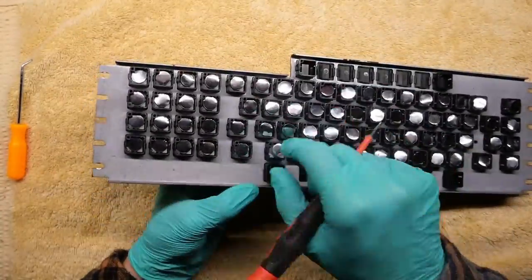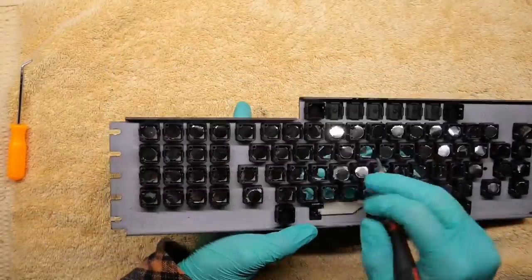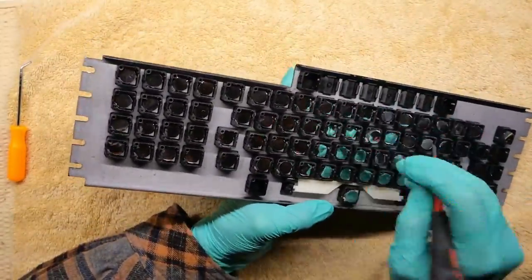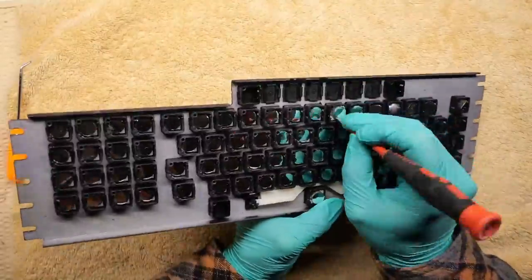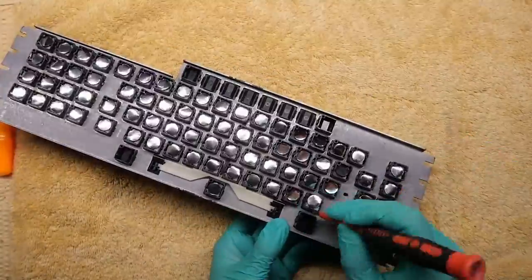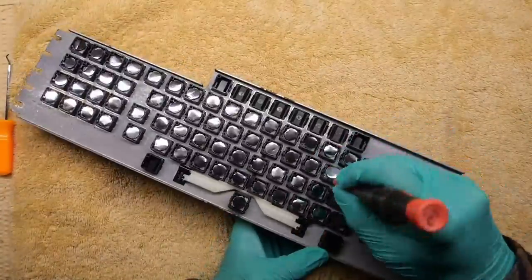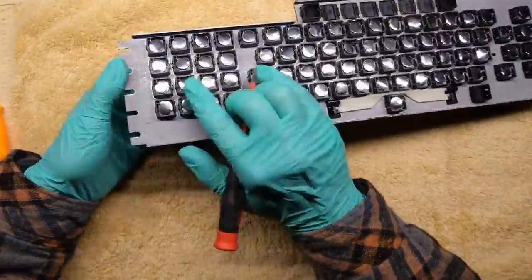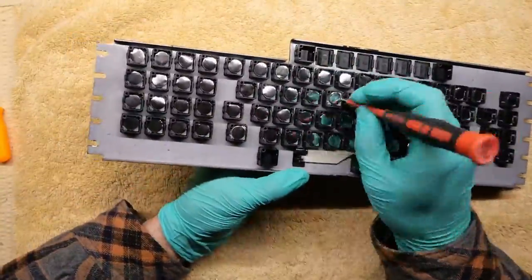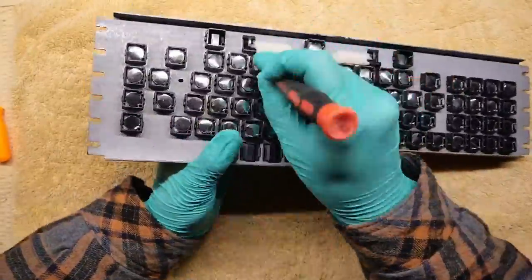It is absolutely imperative you have every plastic disc fully inserted into each slider. All four of the prongs need to be clipped around that plastic disc. If you miss one of the prongs, the entire pad is offset, and that's going to cause problems. In fact, what I do is I go through the entire keyboard once, make sure I've clipped everything on, and then I actually go through it all over again and double check that everything is still clipped. On this keyboard, I actually found that there were about three or four sliders where I had left one of the four prongs unclipped from the disc, so I found those and I got those clipped on. As I mentioned, this process is long and tedious, so put on some music or a podcast and just be methodical about it.